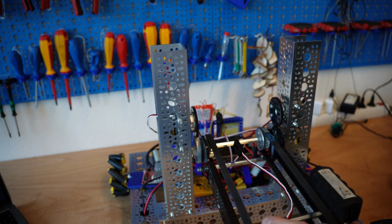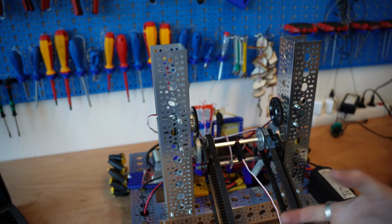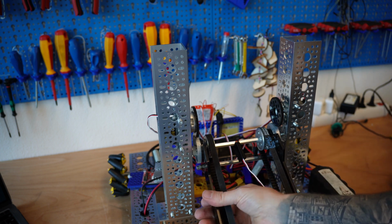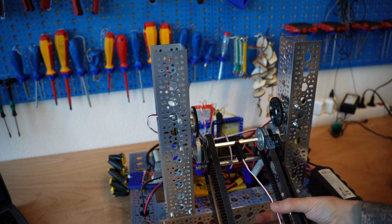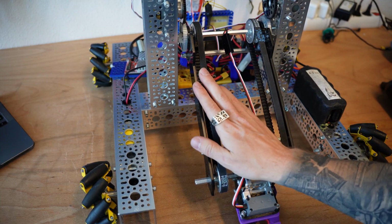Belts and pulleys tend to be a little bit lighter than some of those solid metal links. And when you set this up, you get some really nice smooth motion that keeps things consistently parallel. Sometimes having this a lot more compact really helps things get a little more rigid. It also helps things be a little bit easier to put together as opposed to having to find places to put an additional 4-bar. So, some challenges here.